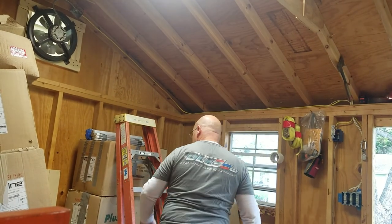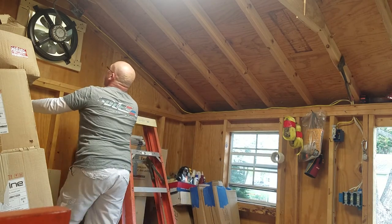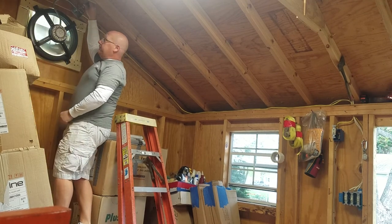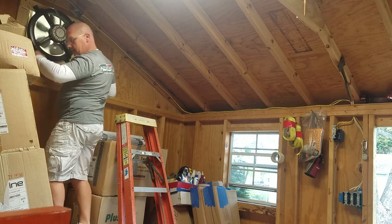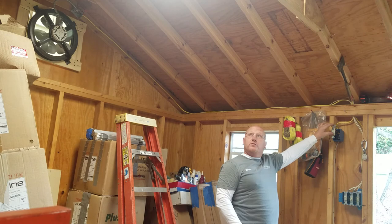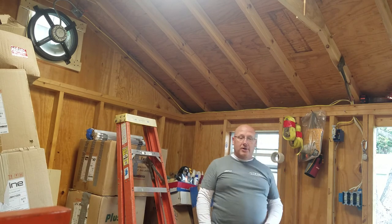Switch is down so the fan is on auto. Let me turn the thermostat down so you can see - it's only about 65 degrees today. I rotate it down and it cuts on. Now if I leave it on 100 degrees, 120 thermostat setting, it doesn't matter - I come over here, throw the switch up, and my fan comes on. It pulls the circuit on the line side going into the thermostat. There you have it. Thanks for watching.